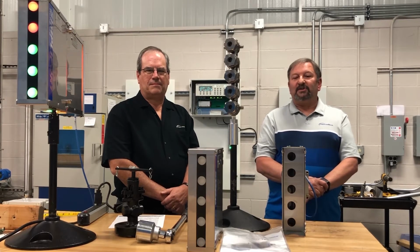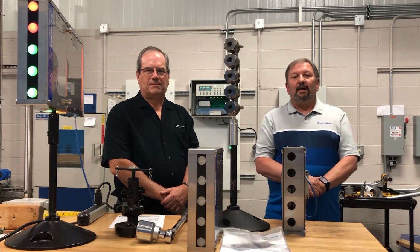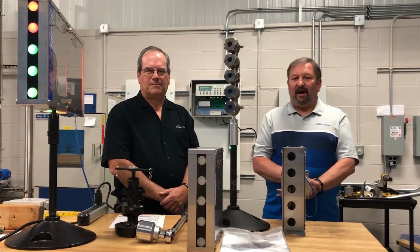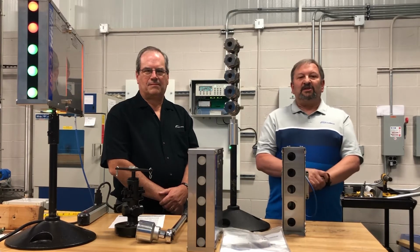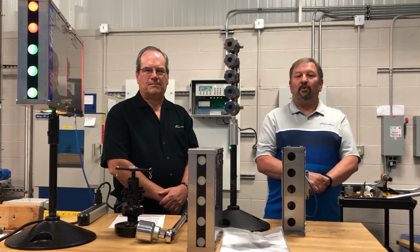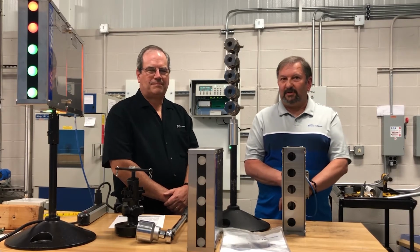Verify that all power is turned off to any applicable equipment. If under pressure, the equipment should be isolated or the boiler should be shut down before proceeding with the installation. Open the drain valve to eliminate any trapped pressure. All inspection and installation steps should be performed by a qualified technician and should be executed in accordance with all applicable national and local codes and plant procedures.